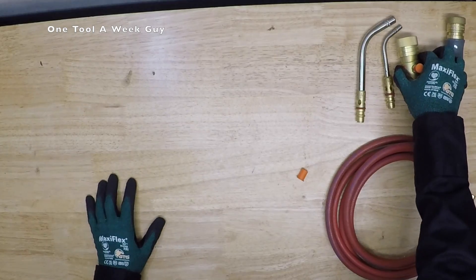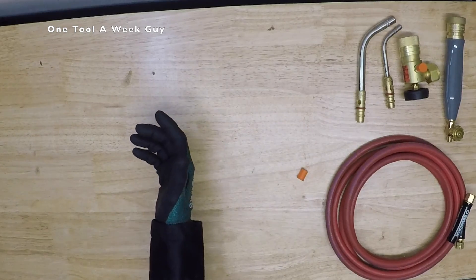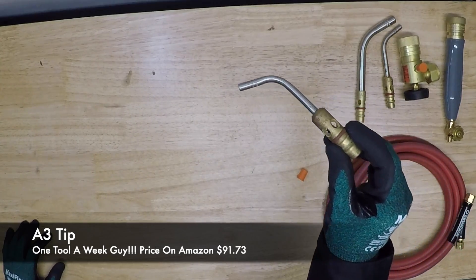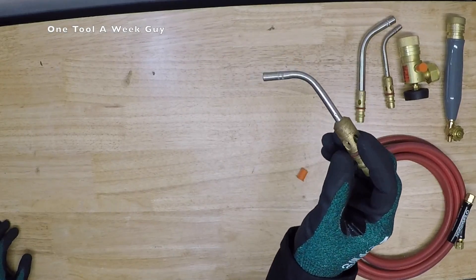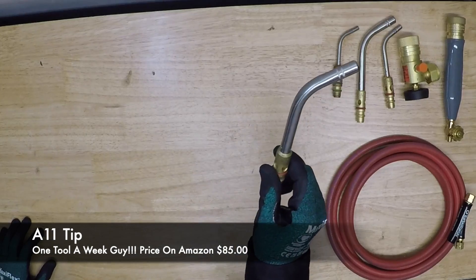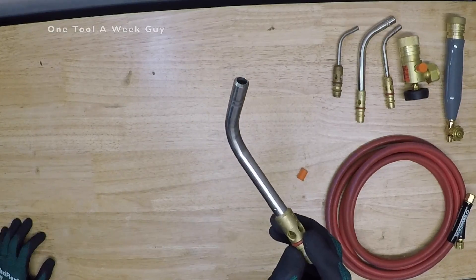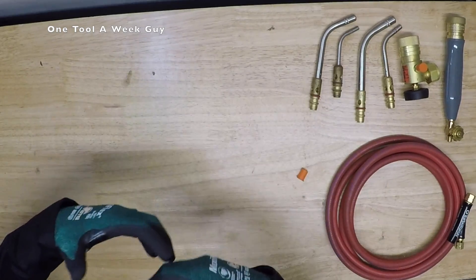Additional items I highly recommend for your soldering or brazing bag: the A3 tip, which runs about $91.73 — it's a tad bit smaller and meant for soldering 1/4-inch to 1-inch and brazing silver 1/8-inch to 1/2-inch. Another one I carry in my bag is the A11, which runs about $85 — that's for soldering 1-1/2-inch to 3-inch and brazing silver 7/8-inch to 1-5/8-inch.